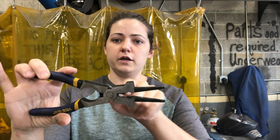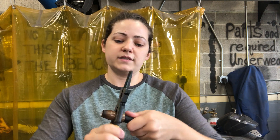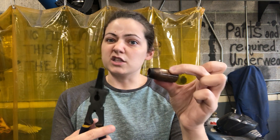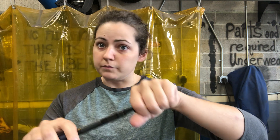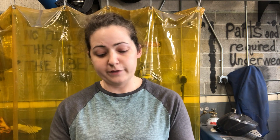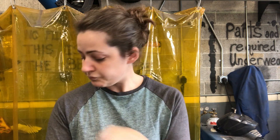You'll notice two holes with knurled edges — those are used to take apart parts of the gun. If I need to clean this nozzle, it should just slip right off, but if it's being tricky I can take that larger knurled hole and twist it off. With the tapered end, nozzles typically get pretty gunked up with spatter, so you can stick the tapered end right in there and clean it out. This one I cleaned recently, but you want to get as much of that spatter out as possible — the cleaner you work, the better.